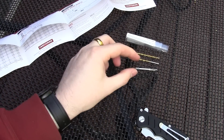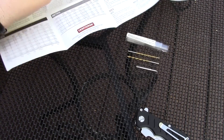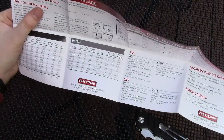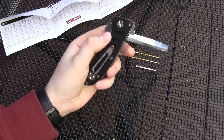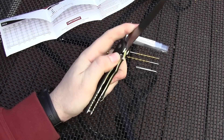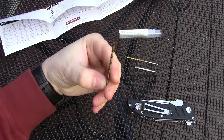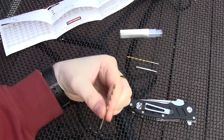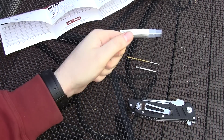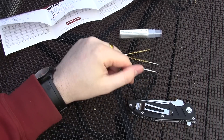It was obvious the hole was too small — this is never going to work. It was so small you could barely tap a soft material; I did a practice thing in G10 and it was kind of too small there too. At that point, this poor guy had been super patient and nice but had been waiting a month for this knife, which I said was probably going to be a simple job. So I got out my standard drill bits and worked upward through the sizes, reaming out the hole in my drill press. It was laborious and annoying, and I ended up breaking one of those bits — fortunately on the third and final hole.